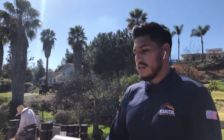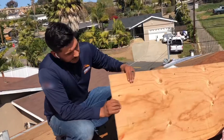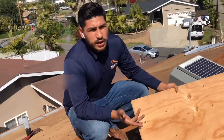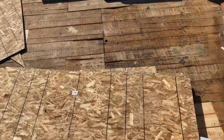Mostly new houses always use plywood. Now the reason we're choosing OSB: plywood does a lot better with expanding and contracting when it gets hot or cold, but it warps. If you look right here, it's layered in plies, and with heat it'll start to warp — leave it in the sun and it'll stay warped. With OSB, it doesn't warp at all. It expands and contracts because there are so many pieces glued together. That's why sometimes you'll see dips in some houses — it's because they're putting on CDX plywood.